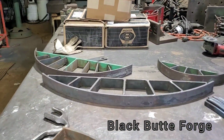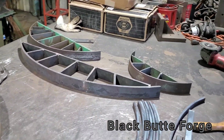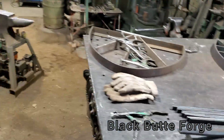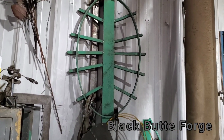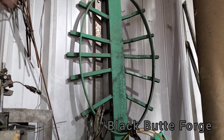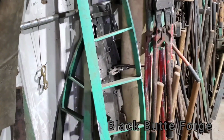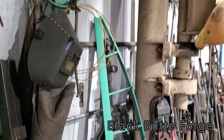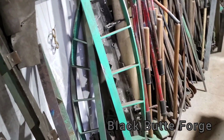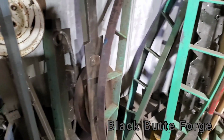And these are just much heavier duty versions, so I can pry things like my cap rails off my gates and things like that. Usually I make these out of 3/8, okay? And then up here, for example, this is just two versions back to back to make an oval, say for signs, okay? But that egg shape, I guarantee something fits. Then down here, I've got even larger ones. This one's as tall as I am, and it's basically just a symmetrical arch. I've got all these various sizes that we've made over the years. And so sooner or later, every project that comes down the pipe, those curves will fit.